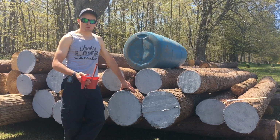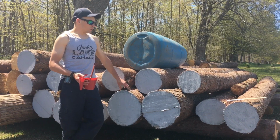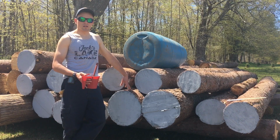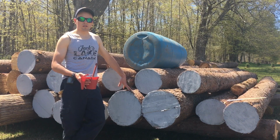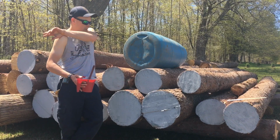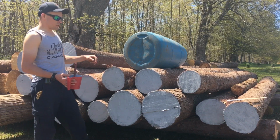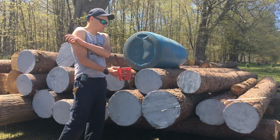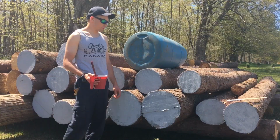So just waiting on the mill, and I'm waiting on my tractor to come back. I read this online, just thought it was worth a try to save some of the really bad checking, and get a little more length out of some of the material, because the ends usually check pretty bad, and you have to cut off all the split material. So I should have enough of this gray to do both sides of all the floor beams, and then I think there's a can of brown and a can of black still in the basement, so I'll just keep at this. Nice day to be outside.